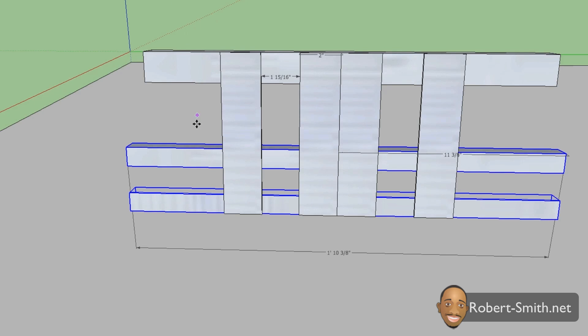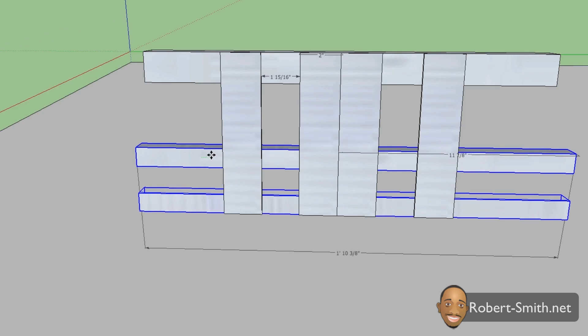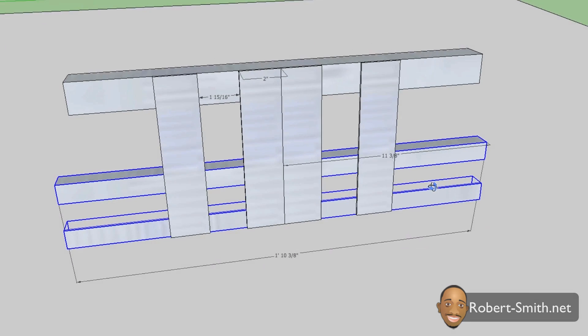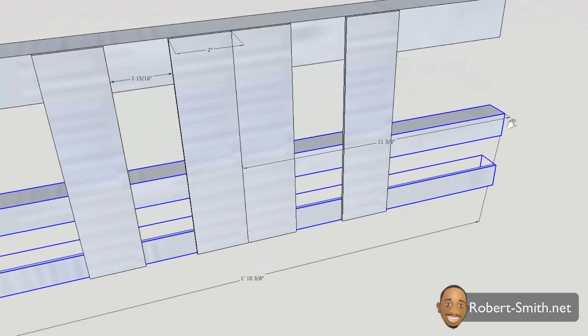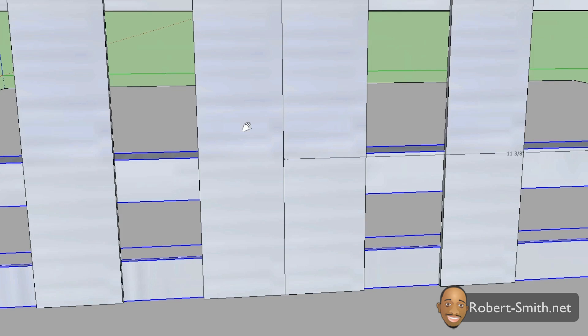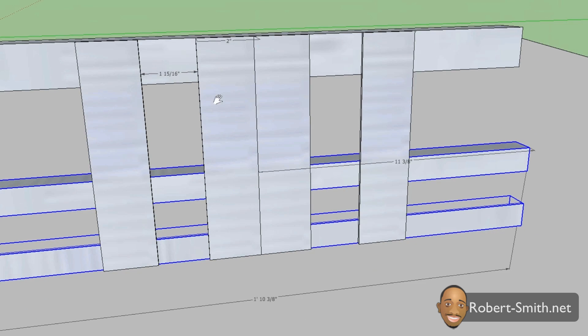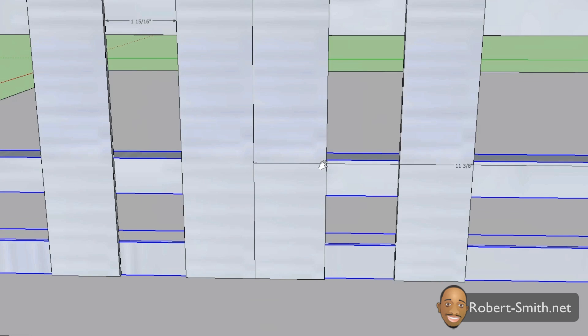The problem you could run into is you may make your markers a little bit off — these two pieces might be too far to the left or too far to the right. It's very important that these two pieces are centered with this top angle aluminum piece. All I needed to do was find the midpoint for these two aluminum pieces. Once I found that midpoint, since the connection pieces are two inches in width, I measured out two inches from that midpoint and made a mark for where each connection piece would lay.